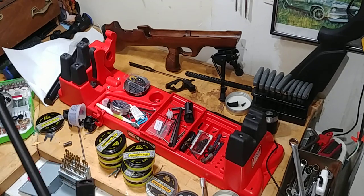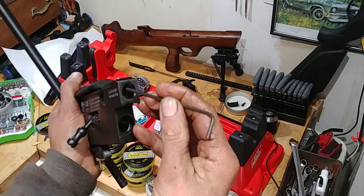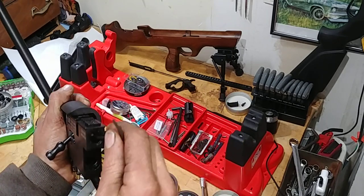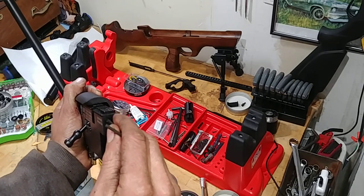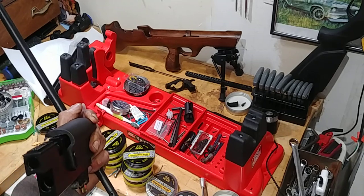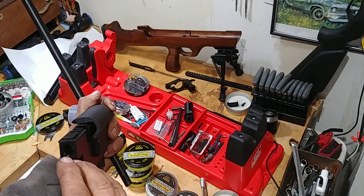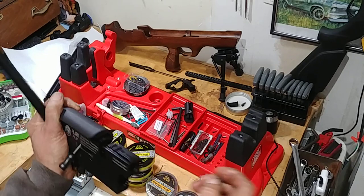It doesn't come out the other side, but you have to be careful because you have to go inside now and clean up any flashing that is in there. So you just don't want to be going crazy and nicking all this up, because that is where the O-rings seat in here. So you do not want to damage that. It's a little timely process. That's why I said by the time me doing it, I'd make an 8 or 10 hour video. So I'm not going to bother doing that. I'll just explain what I'm doing and how I'm going to do it.